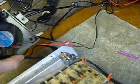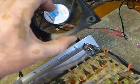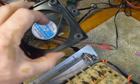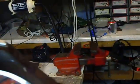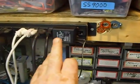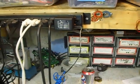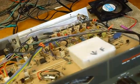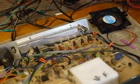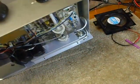I also added a cooling fan on the back. It's a 24-volt fan running on a 12-volt power pack — the power pack is up here. You can get those at garage sales. That works really well for cooling because the heat sink gets really hot when you're running CW.